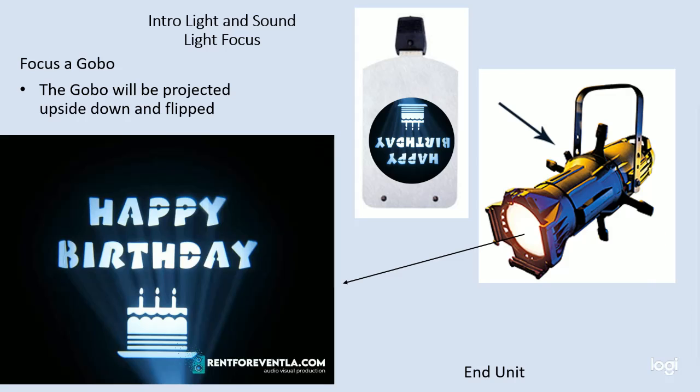That's a little bit about installing gel and gobo. To make the gobo sharp, it's the same process of sliding the lens tube in and out — just like sharpening to the shutter, you would go sharp to the gobo. Sliding the lens tube in and out is what will allow the image to be crisp and sharp, or if you want it a little softer, you may slide the lens tube a little more in or out. Before you're done, make sure that the lens adjustment has been tightened back up.